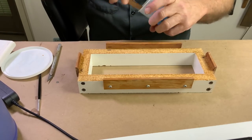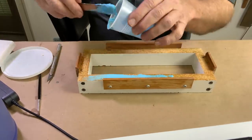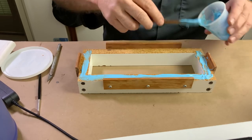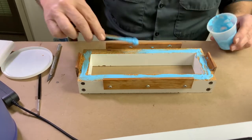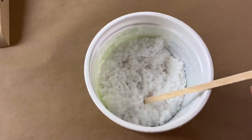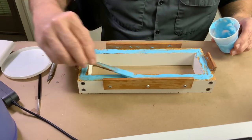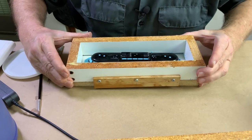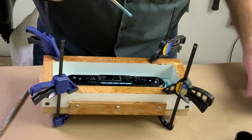As we assemble the wooden box parts together, there is the possibility that the mold box could leak. To prevent it from leaking, we're going to lay down a gasket of rubber. This is just the same rubber we've been using all along, but it has included in it some polyethylene mini fibers — a white powder. It's a super fine, fluffy white powder, and what that does is it turns regular pouring rubber into more of a paste, which is excellent for building gaskets. Flip it over and set it, and I can see the gasket material just squeezing out perfectly all the way around. We have 100% gasket seal all the way around the box.